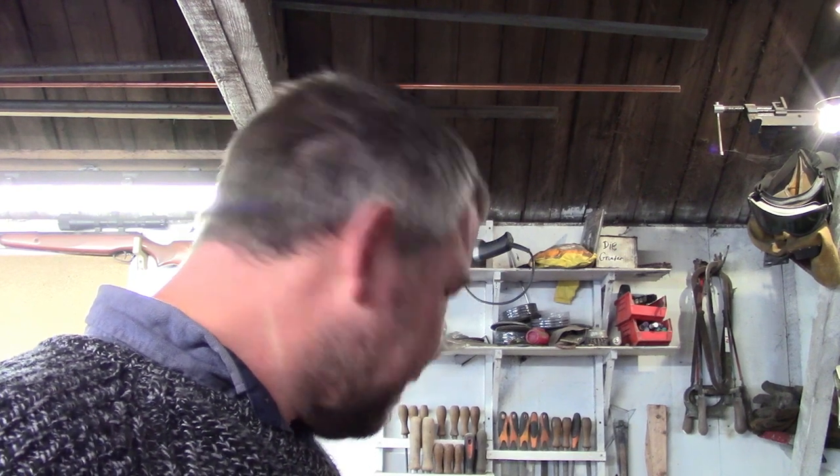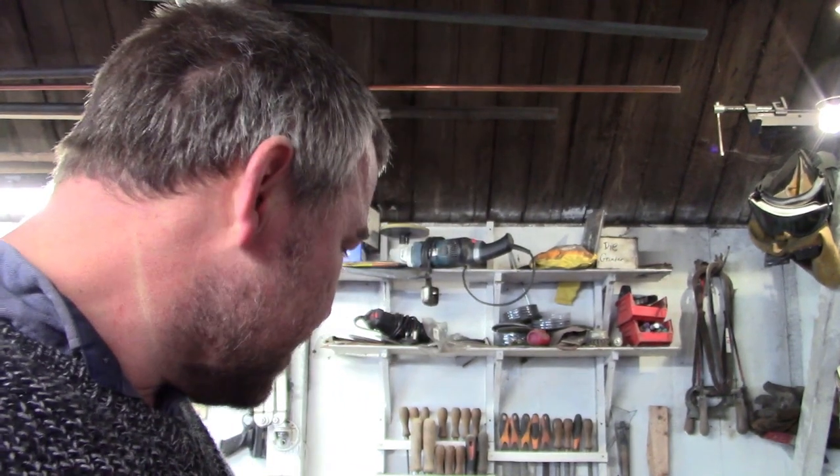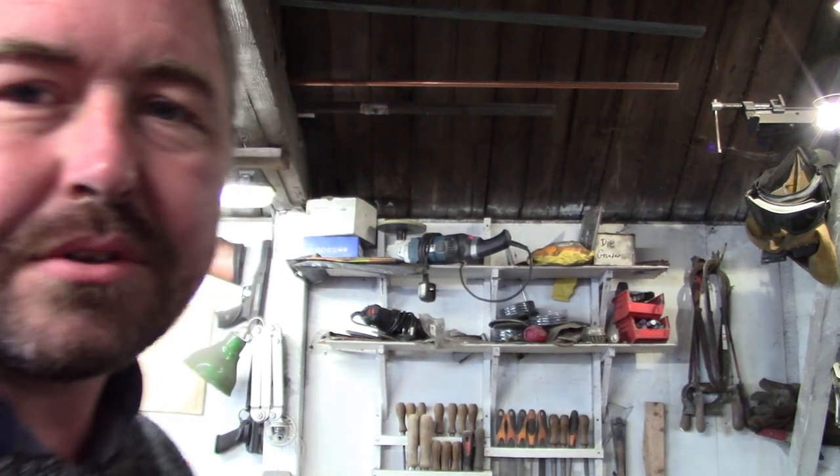Another little video on welding with fire extinguishers. Those of you that have been paying attention for a very long time will remember that about 2 years ago, it might have been more, I did an emergency welding with fire extinguishers video. I showed I'd run out of gas, so I rigged up a fire extinguisher to the welder and carried on welding using the CO2 as a shielding gas.